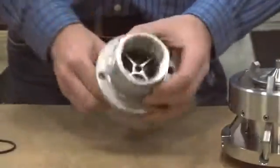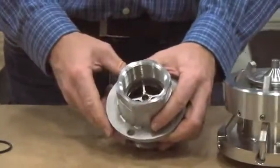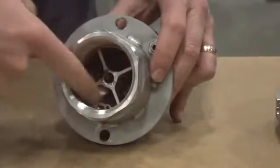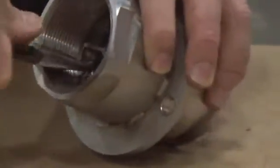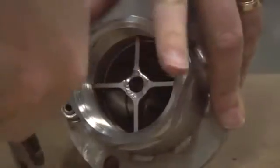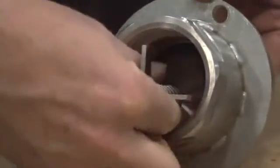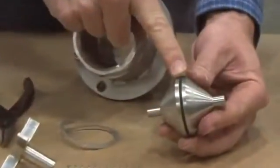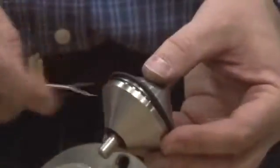Next, we'll remove the first poppet and replace the O-ring on the inside of the NTS-PU unit. We'll start by removing the locking ring. Begin by opening the safety tab using your needle-nose pliers, then pull the locking ring out. Once the ring is removed, use your fingers to pull the poppet through the unit, exposing the seal. Here we have the poppet, the spring, and the guide. This is the O-ring we want to remove and replace. Take your seal pick and gently pry the seal out of the groove in the middle of the poppet.